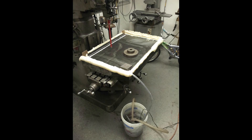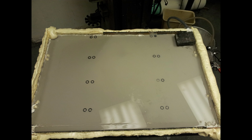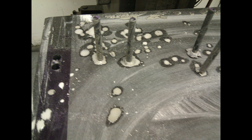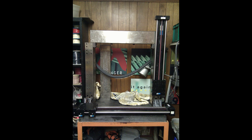To irrigate the cut area, I sealed the edges of the surface plate and used an aquarium pump with a gravity tube to consistently pump water from a bucket back onto the surface plate. That worked extremely well. In short order I had all the holes drilled. I never drilled all the way through so the water couldn't come out at the bottom — I left just a sliver at the bottom, which then came out easily at the very end by simply tapping the cores and they fell out. Then I just had to clean up the surface plate and mount everything together.